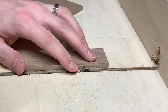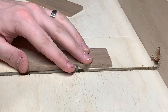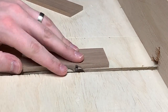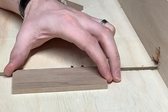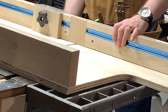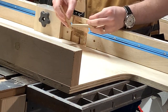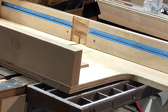So measuring the height of the material, I'm going to cut some box joints in — this is just a couple of test pieces of walnut scrap I got left over. Setting the height of the stack. I did put the dado stack back in. So I've got a fresh insert in the fence, we're going to run it through and put a slot in the insert. Now I'm going to take the insert out and check my key — a piece of quarter-inch scrap that I'm going to use as my key.